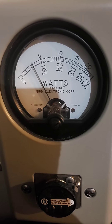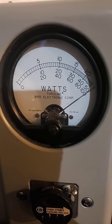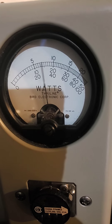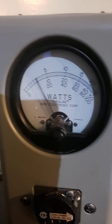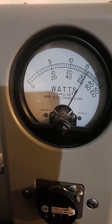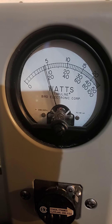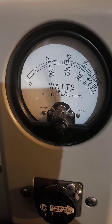Alright, let's see what she modulates. Carry it all the way down — she modulates. I'm off the end. I suppose if I turn it up it's gonna do the same. I'm off the end. So if we put it on the two-time multiplier — you see it does about 32 to 34 watts, somewhere in between there. That's with the carrier rolled all the way up. We'll roll it back down — should swing about the same.